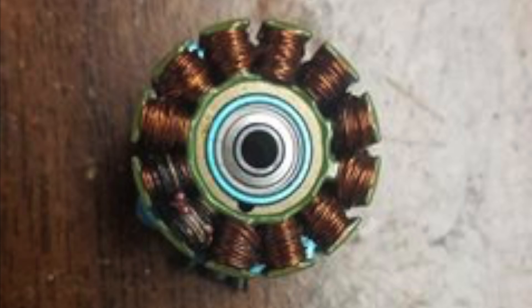One of the unfortunate things about this: if you go to swap that motor — you see the motor's fried, you see black coils — and you put a new motor in, that new motor is then going to fry too, because your MOSFET has been shorted and it's now shorting the motor every time you plug it in. So usually if you fry a motor and see black coils, you need to replace both. Using a smoke stopper will actually save your new motor if you want to test whether you need to replace the ESC — but if you see any black on your motor, more than likely throw out both the motor and the ESC.